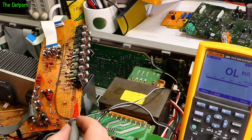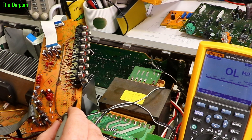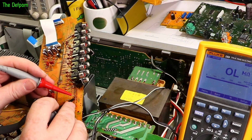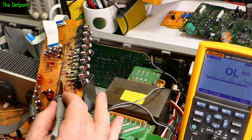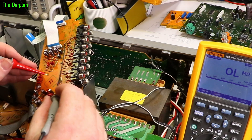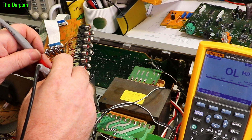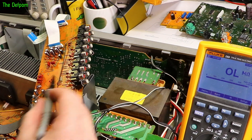There's some adhesive tacking down these cables. I've actually seen on old CB radios this kind of glue become conductive and corrosive. If I test this one over here with the probes — absolutely nothing. But these ones over here have two wires running through and are darker. Where it's still soft and pliable it's a good insulator, but where it's drying out it's starting to conduct — 50 megaohms. This needs scraping off before it becomes a problem.